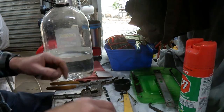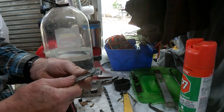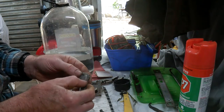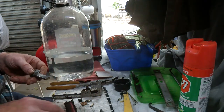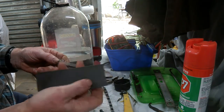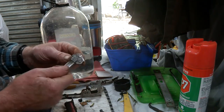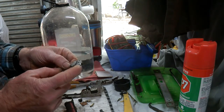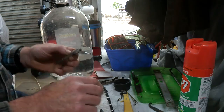I've left all of the mechanical parts sitting in petrol overnight. This one I've cleaned up a little bit more — even out of petrol it had a few stains on it. I've used pieces of emery cloth, put some petrol on it and cleaned it up. So that's now nice and smooth, the mechanism moves quite freely, and all of the scunge inside has been taken out.